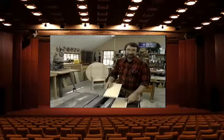Well, the table saw is next. I've set it up with the dado cutter, and I need to make a 1/4-inch groove to hold the plywood bottom. Now, with a slight adjustment to the rip fence to compensate for the rabbet, I'll put a groove in the drawer front for the plywood bottom.